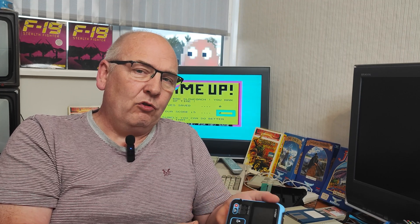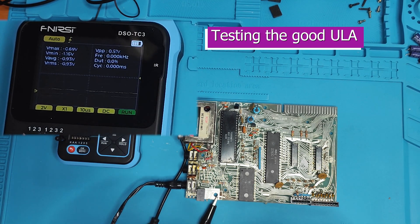You could go on and test various different things on there. It does mention it can do other types of components as well — inductors being mentioned and some other bits and pieces. But it seems to do what it claims. So the whole real point of me buying this is to see if it can help me diagnose faults. The next thing I'm going to do is test it on one of my ZX81s. I recently found a fault with the ULA and had to guess the fault, swapped it out and fixed it. What I'm going to do is try it with the good ULA and the bad ULA and see if using the scope I can see the difference.